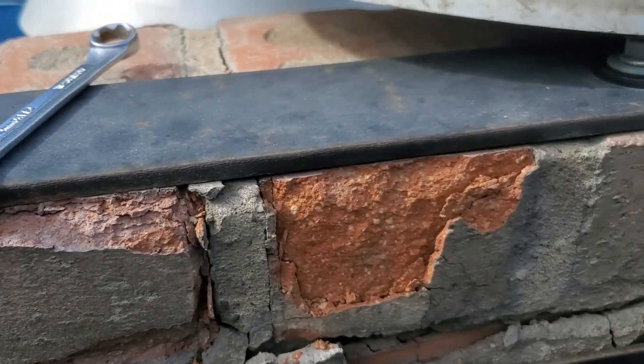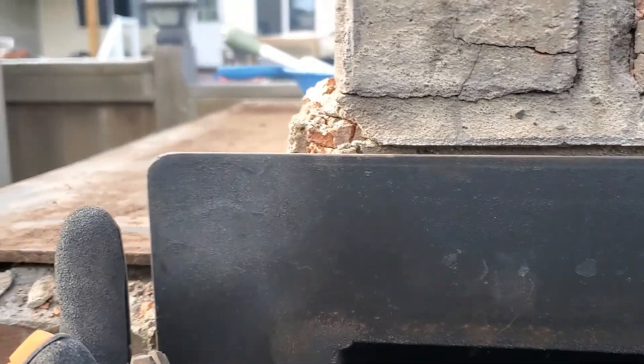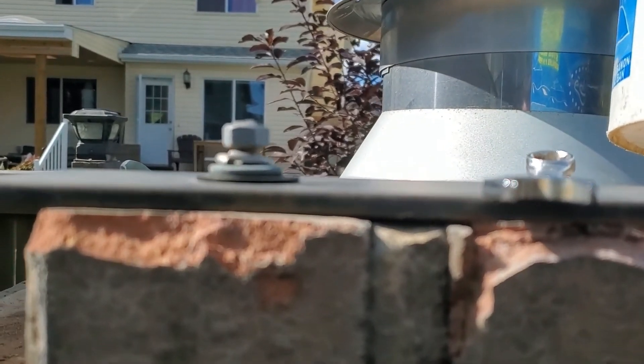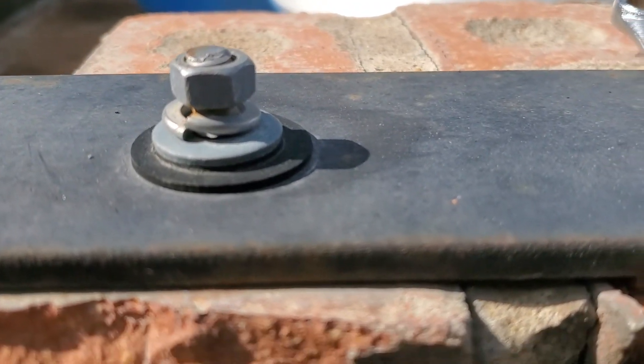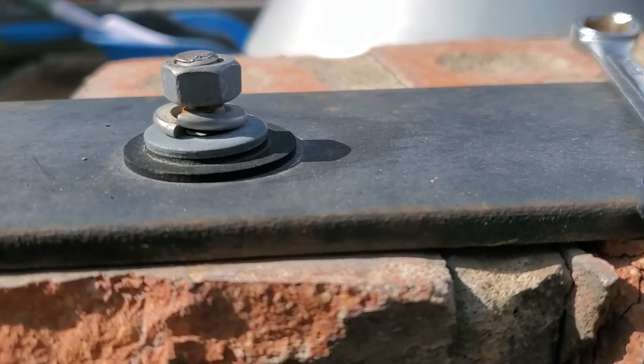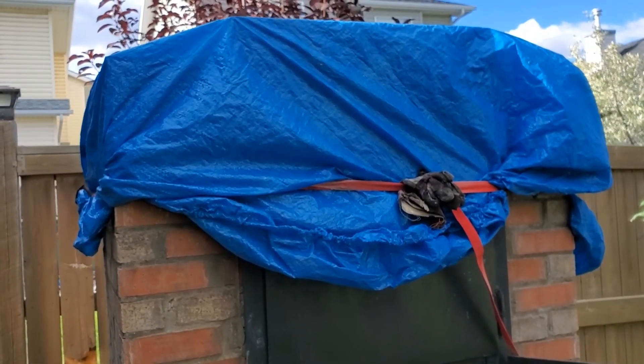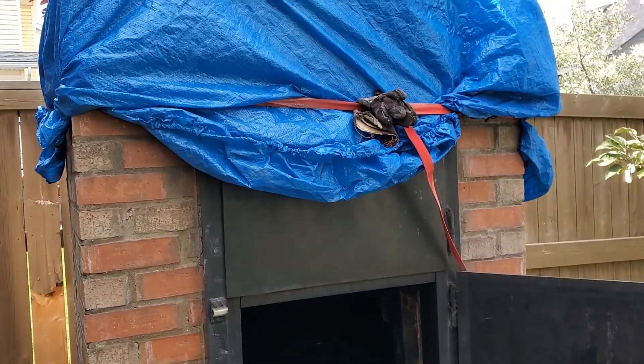I also have this metal plate up here, and when this door frame had first broke loose I had to angle it forward just a little bit. It wasn't in danger of coming out because it was catching on the brick with the angle iron. However, I wound up drilling through two layers of brick and the angle iron and the plate steel, running a threaded rod and securing it — but I won't be using that on the new version. I got that roof off and everything tarped up, and now I need to get everything emptied out and get some forms prepped.